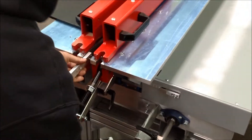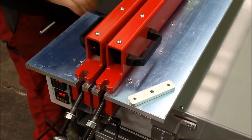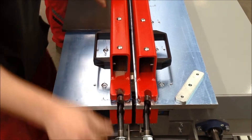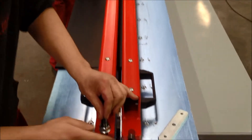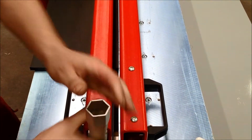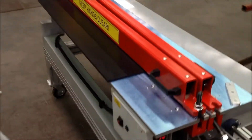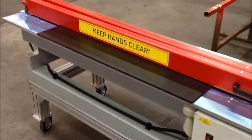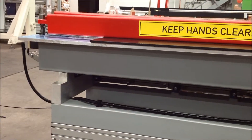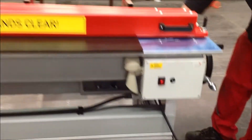The first thing we need to do is set a gap between both tables equal to the thickness of the material we are going to weld. The second thing, after adjusting to this gap, is correct clamping. The clamping of the material goes from the left-hand side to the right-hand side of the table, and it's important that the clamping is done correctly left to right, so you have the same pressure throughout without needing two-part clamping.